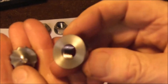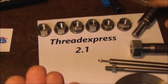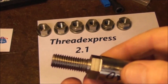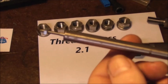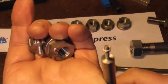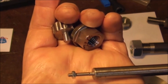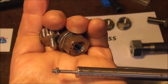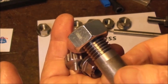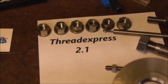All of these tests are coming out really well — machining hexagon nuts, threads, bolts — all in the one setting, the thread and the hexagon. And from the previous video, tests such as machining a very small slender 3mm screw — that's less than an eighth of an inch — with thread milling, using much lighter machining loads than you get with screw cutting.